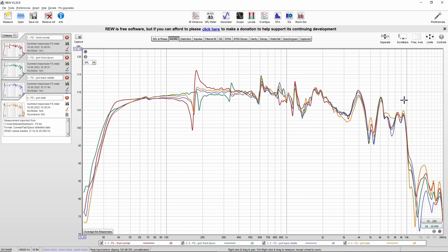As I hope that my explanation is satisfactory, I muster the courage to move on to the floor standing speaker. While I breezed through the subwoofer, I want to take more time with the floor standing speaker and see if we can draw some conclusions. So first of all, let's look at the overall responses. Basically, they look pretty much similar in terms of efficiency and how low they go. The initial position of the port — the red line — looks a bit better compared to the rest of the port locations. You can see over here it has better low end response.